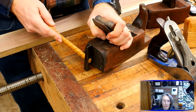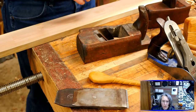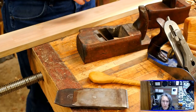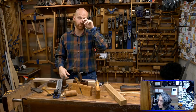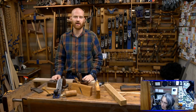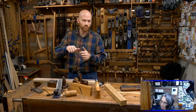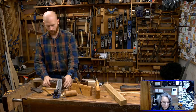Joel asks: I saw a person use a thicker pane of glass as a card scraper — have you ever tried this and how well does it work? You have to be careful because glass has edges, but if you actually break a piece of glass you can use that sharp edge to scrape with — and it works very well. A lot of people use pottery as well, though pottery tends to have a more jagged edge. Glass has a nice clean breaking edge. It was very common for whittlers back in the day — they'd whittle with a knife and then take the glass to scrape it down, round it all out, and make it smooth.